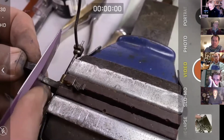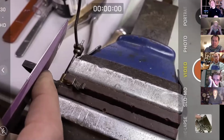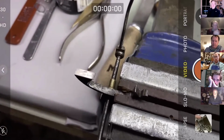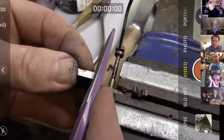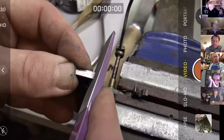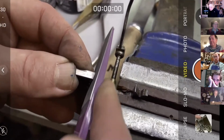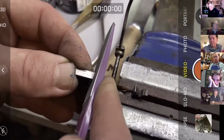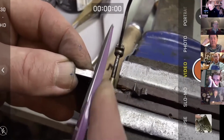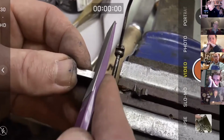If you get to the point where you need to reface pallets, I would say reface rather than bending the pallet frame, because as much as this is quite an interventive process, at least, to the best of our knowledge, we're retaining the shape of the pallet frame. Now I'm trying to avoid damaging the frame underneath with this diamond file. With us using this material that we now know is incredibly hard, I suppose that might cause a problem, but we know this probably won't have to be done for decades.